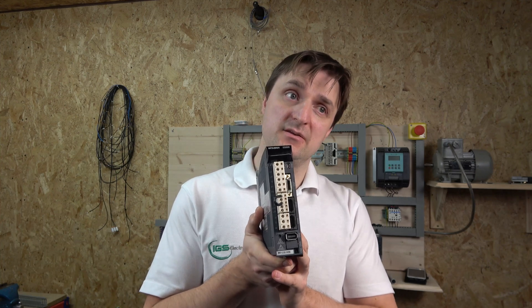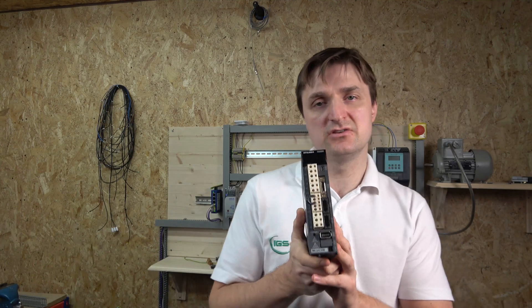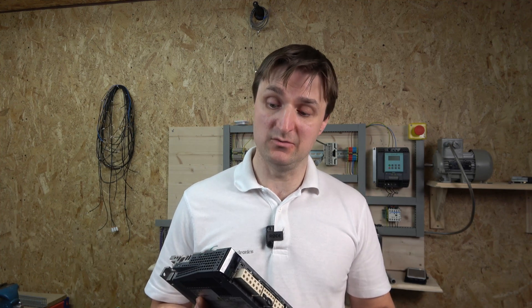There are a couple of softwares you can use, at least for the J3. For J2 or J3 you can use MR Configurator, and the one we're going to be using is MR Configurator 2. Unfortunately that one is not free, but if you head to the Mitsubishi website and register with them you can get MR Configurator for a 20-day trial. So do try to register and see if you can get one if you want to start playing with it.